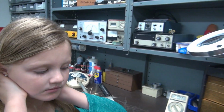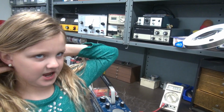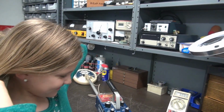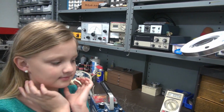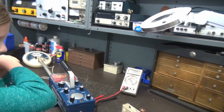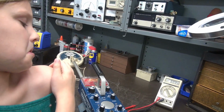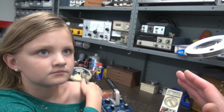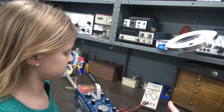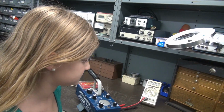Right. And this is the most common failure on these metal detectors. When people contact me and they say my metal detector is intermittent, this is the first thing that I tell them to look at. And you know what you do if you have dirty contacts like this? You change the battery pack. You do not attempt to clean it. These things are like $15. You just put in a new pack and your problems go away.